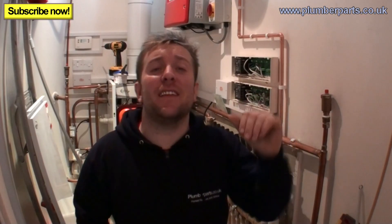I'm about to fill the system up now. I'm going to fill it up cold to one bar, then turn everything on and watch it rise up to one and a half bar, and just sit there as the water expands into the new expansion vessel.